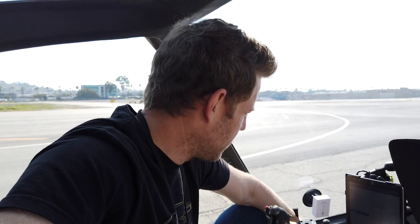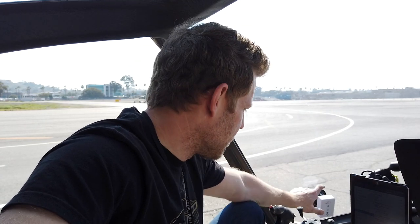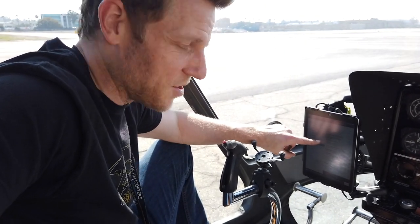The same people who make ForeFlight also have ADS-B in functionality. ADS-B is a technology that's going to be mostly mandatory for general aviation, wherein your aircraft constantly transmits its position and other aircraft can see it — so it pops up right here on the iPad. It also has a carbon monoxide detector, so if dangerous gas enters the cabin from the engine compartment, it'll alert me. And it has a dedicated GPS, so the iPad doesn't have to use its internal GPS or cellular technology, which saves battery. As a backup, I have an iPhone.